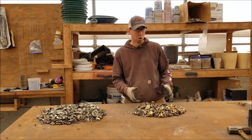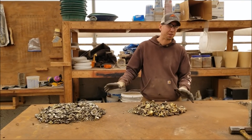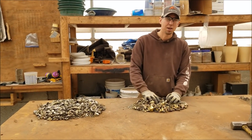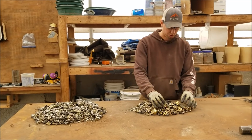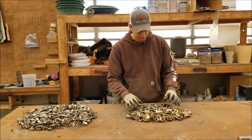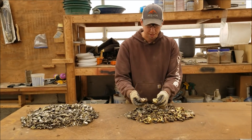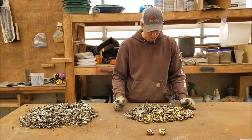Here's the results of our doorknobs through the hammermill, and I haven't handpicked any of this — this is just how it came out. This came off the end of the conveyor. All the magnetics have been pulled out of it, so this is all non-ferrous. You really have a whole mix in here. There's a little bit of pot metal, and it looks like there's a couple different grades of brass — there's a yellow and maybe a red.